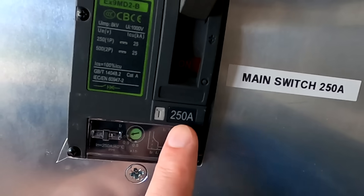I have limited the charge current into the battery one and a half weeks ago. It was pushing over 250 amps into the battery again and we have only a 250 amp main breaker.